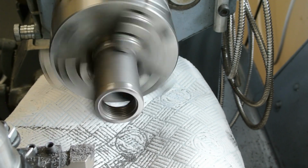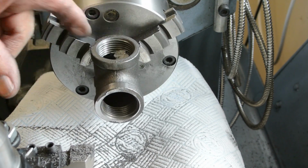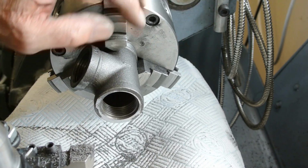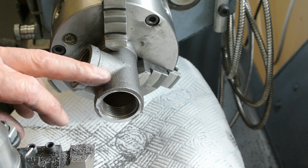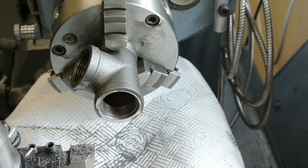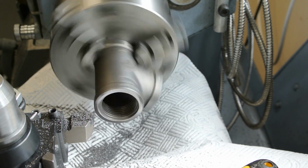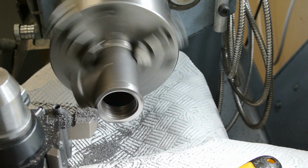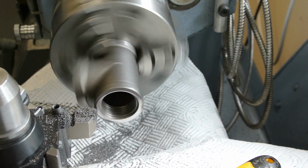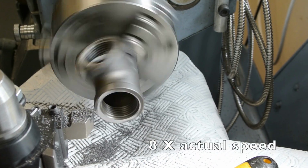Yep, that's pretty true. And also it's gripping over a flat surface in here rather than the casting, which is very irregular in places. So that's much less of a strain to give those very tiny wee cuts. But this end no doubt will be about 1 millimetre off in terms of waving about and wobble, eccentricity. Yes, it's about 1 millimetre between the highest and the lowest point.